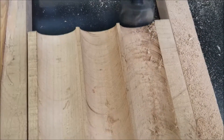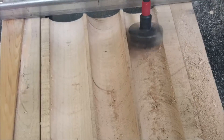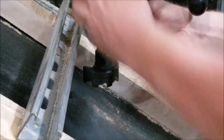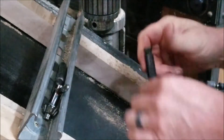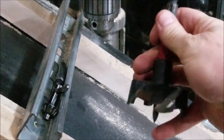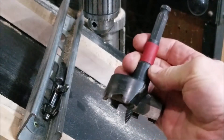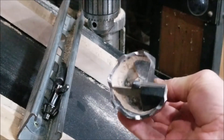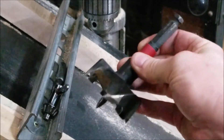I'll show you which cutter this is — it's a Milwaukee Switchblade. They're usually used by plumbers to hog through wood for drain pipes and vent pipes in houses. If you've ever used one, you really got to hang on, because it hogs through wood like crazy. It's got one heavy-duty cutting blade — pretty wicked. Way better than a hole saw for doing rough holes.